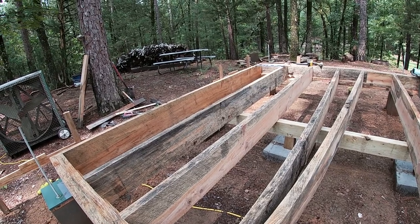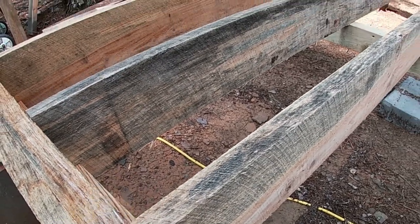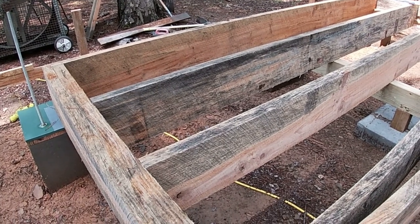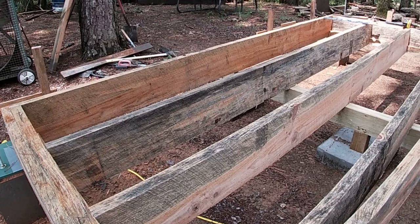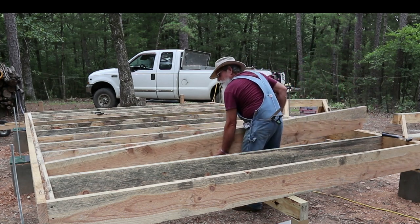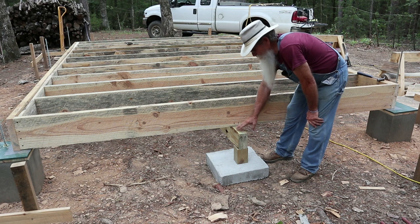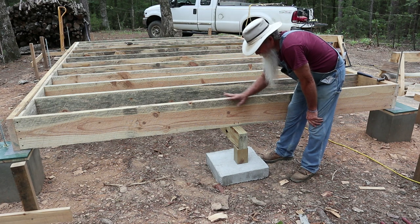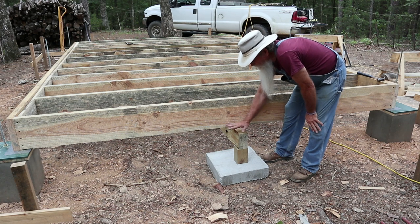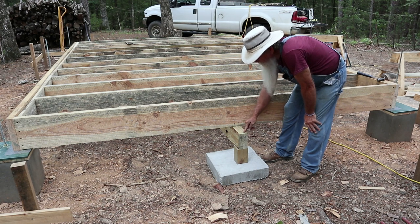If you buy your floor joists at the lumber yard they're going to be an inch and a half in thickness, but since these are different thicknesses I cannot use joist hangers because they won't fit — some of these are up to two inches thick and so a joist hanger really wouldn't work well. That's one of the reasons I put the ledger on, so I can set the joist on top of that with the notch out. The end of this girder is out from this first joist, and that will carry the weight of the middle. The half log will set on top of that — all the weight in the center of the logs and D wall will be transferred down to the ground, sitting on the girder and the post and the pad.